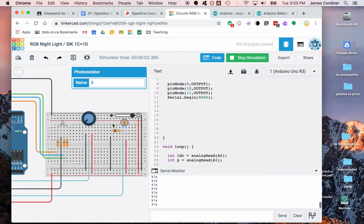They both are, but this one's really showing us how we can make use of the fact that some device like a photoresistor varies in resistance under certain conditions, and there are other things like that. Any sensor will probably work something like this in some way. Some physical property causes this thing to vary its resistance based on light, but it might be because of heat, or it might be because of tension or pressure or flex in metal. It might be all sorts of different things. And how do we work with that? Well, we use this voltage divider setup and we read it off into our code. And then from there, it's whatever we want it to do. Oh, it's too dark, turn on the light. Other things can happen. So let's stop there. Hopefully that gives you some more information. And when you read about voltage divider, you can look at that formula, and hopefully make a little more sense of it.